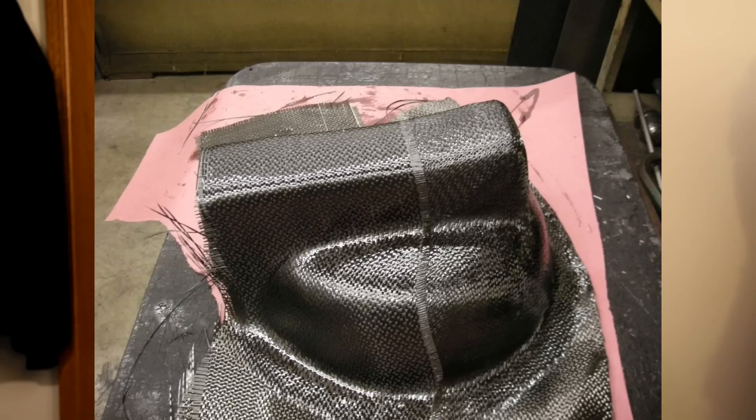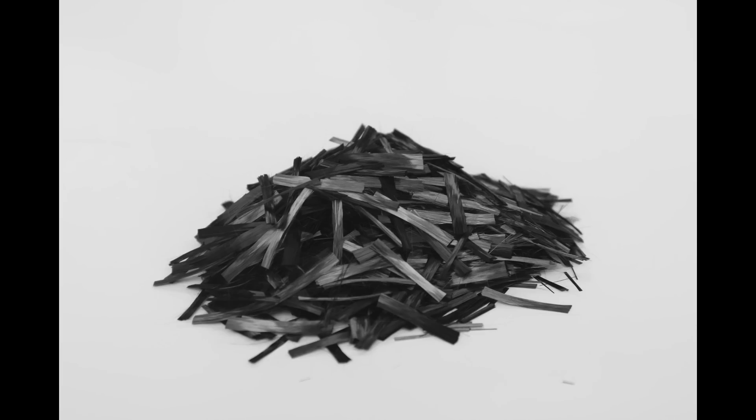So what is forged carbon fiber? Regular carbon fiber is made from woven fabric sheets of carbon that are placed in a mold, resin is applied, and it's cured at high pressure and high temperatures — it takes a long time and it's a very tedious process, which is part of why carbon fiber is really expensive. Forged carbon, on the other hand, uses chopped fibers instead of a woven sheet. They put resin on them and can cure it at high pressure but without the high temperature. You can think of it as fiberglass but with carbon instead of glass.